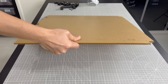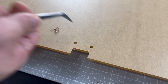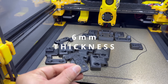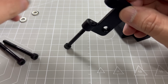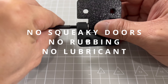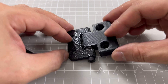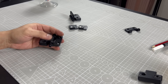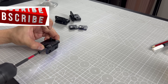We are going to assemble the doors now. These panels are clearly laser cut, as some of the offcuts are still there. I designed and printed my own hinges — each door will have three hinges to hold an acrylic door that is of six millimeters thickness. To achieve a smooth opening door, I added one washer for each hinge. This way, there will be no squeaky doors, no plastic rubbing against plastic, and no lubricant will be needed. When creating the 3D model, a lot of time was spent planning the size and length of the bolts to use. It's pretty amazing how every part fit together nicely, exactly how it was designed.